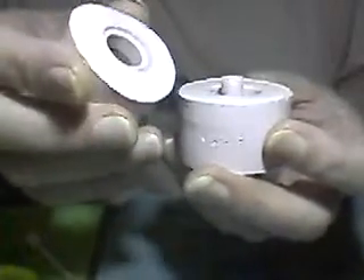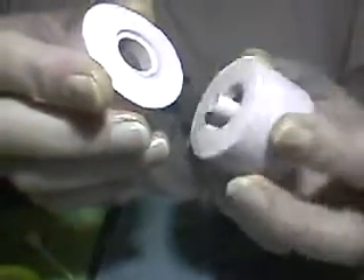The problem was that I didn't use enough silicone, and I tried to remove it from the cast before it was properly hardened so it got a little bit deformed. But that's not a big deal - I can see where it lines up because it isn't perfectly straight and there's a red line, but there are little imperfections which line up - a little bit that sticks out there fits into there. I can see where they go when I prepare this mold for the next time.